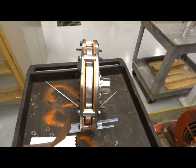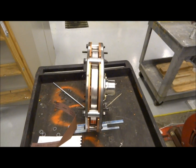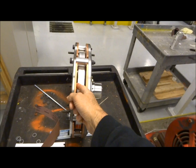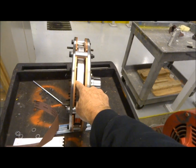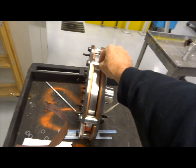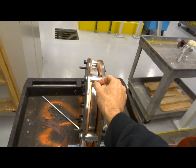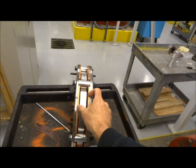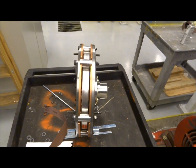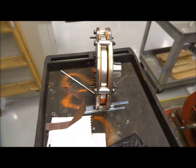It spins at a slightly slower rate than the motor, so there's just a little bit of slip, and because of that you get quite a bit of energy savings. This gap here is what creates the slip and it's adjustable — this one's got about an eighth of an inch. These spacers right here, you can pull these little washers out and put them on the inside to increase the gap, which in turn increases the slip, giving you even more energy savings if you can get by with a little bit less flow.